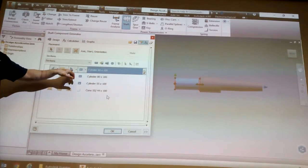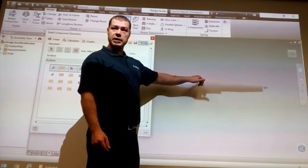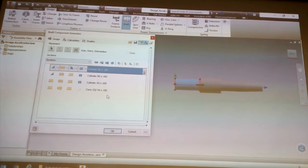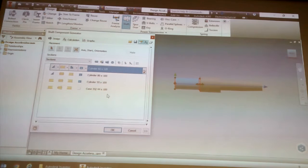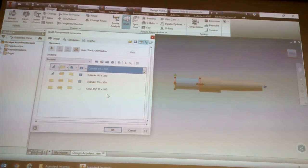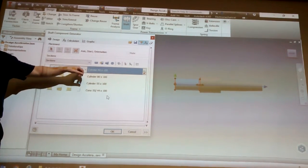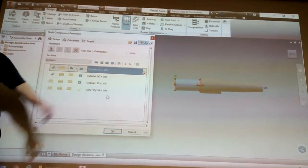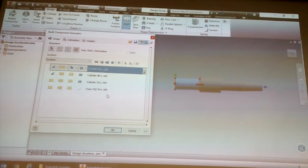And then how does it end? So in this case, it's got a fillet. So what it does is it's filleting here. Like you might want to have a recess for a bearing, so a bearing can go up against the side of the shaft. Because obviously if you have a fillet there, it doesn't matter who you're related to, that bearing's never going to go all the way down to the other side. So you would have to have some sort of a groove or a recess there. And then the last section, this actually allows you to add keyway grooves, I think there's O-ring grooves, there's a whole bunch of different things you can define from that drop down.